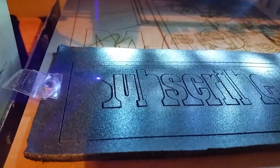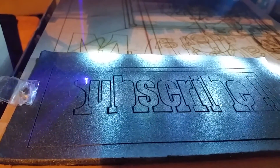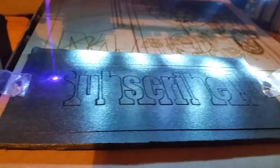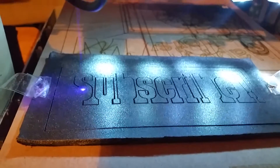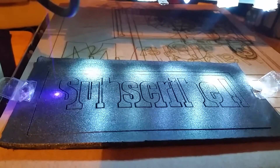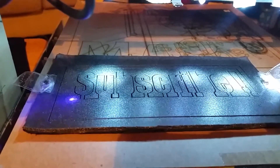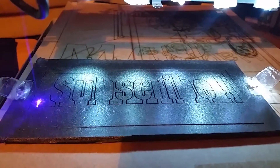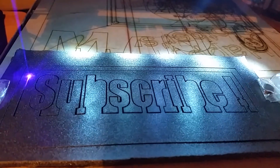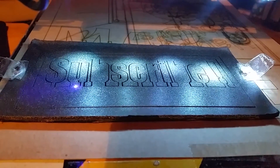It's finishing off the first letter in the word — getting to the tail end of this cut sequence, an unbroken line. If you were to do an etch-a-sketch outline you could probably trace that. It's finishing off that first S — already some of the narrow cuts where spacing is quite narrow show a little bit of warping in the foam. Once it finishes this, it's going to go back up and connect to the top outline on the left side, then go back and cut out all the centers of the letters that weren't in a single line. There are a few gaps in the bridges too.